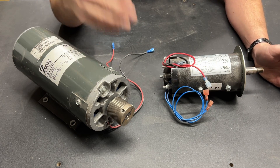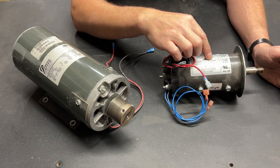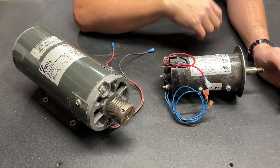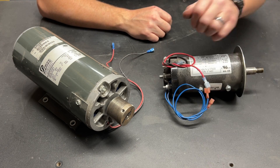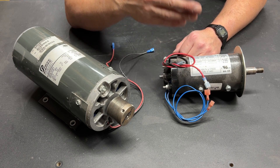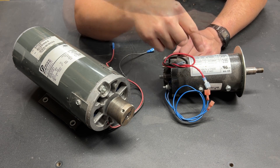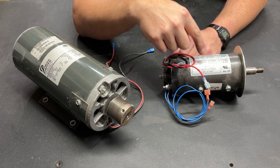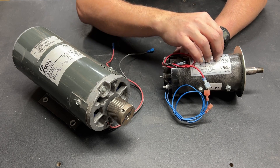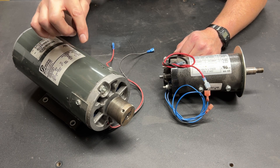Now, there's always going to be some heat — heat is a residual byproduct of any electric motor, DC or AC. But if we have so much more heat coming off this smaller motor, that means we are using more electricity to do the same work. It's very interesting that these big heavy-duty motors never come with blue wires. One might think the blue wires are a safety feature — they are a thermal circuit breaker, designed to cut things off if it gets too hot. You might think the big motor's maker was just cheap and skipped it. But you're looking at it backwards. The small motor has a thermal circuit breaker because it is prone to overheating. The big motor does not have one because it is less likely to overheat. It's not an added feature on the smaller motor — it's simply not needed on the bigger motor because it's correctly sized, turning at a reasonable RPM.